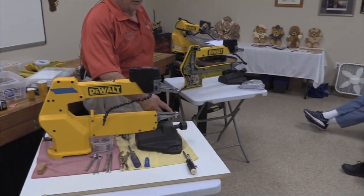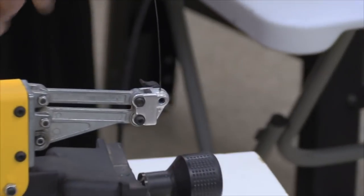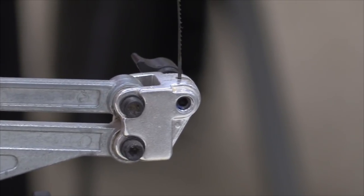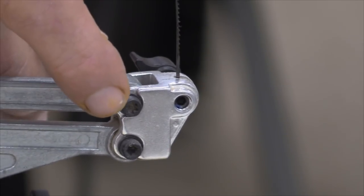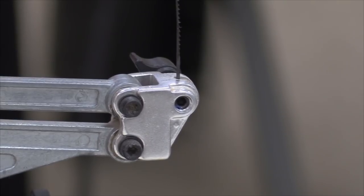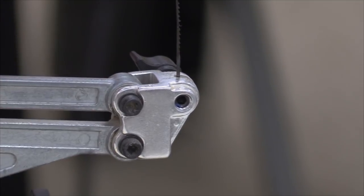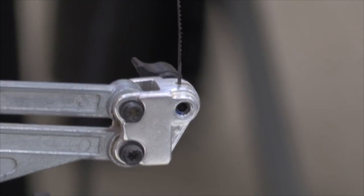It will more than likely have some, because there is no way that you can tighten this screw enough to take all that play out. What will wind up happening, though, on an awful lot of these bearings, almost all of these needle bearings have a sleeve that goes through them, and the purpose of that bolt is to capture this casting and smash that casting firmly against that sleeve. So there's two needle bearings there and two at the top? Yep. There's two needle bearings here. There's two up there. So you go through here, there's one needle bearing inside here, another one inside there, another one here.